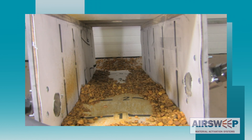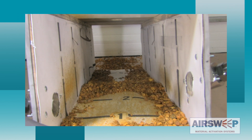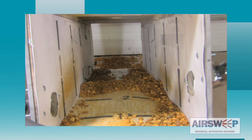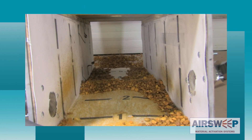Two straight shooters still aren't enough to clean out the entire chute because of the shallow angle. For an application with a shallow slope angle and heavy material like this, at least two more units would be necessary around the midpoint of the chute to push everything out the entire way.